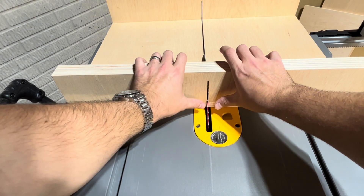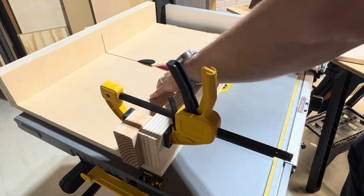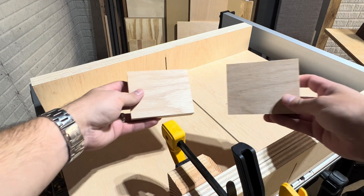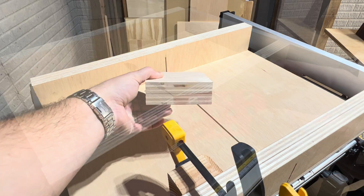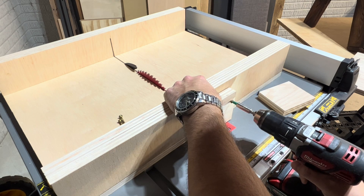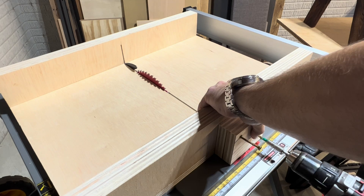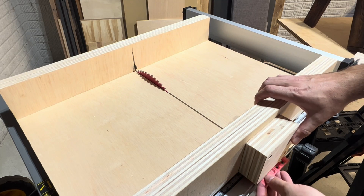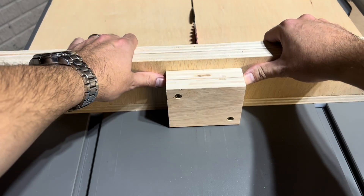Next we need to add protection to the back of the sled to help keep your hands away from the blade for safety. I clamped down a scrap piece of lumber for a stop block and cut two pieces of three quarter inch plywood at three inches high by four inches wide. I used a 1/16th inch spacer — though a variety of materials would work. Align the first piece to the blade and secure it with two inch screws, then place the second piece over and screw in the screws in opposite corners. Remove the spacer and now when making cuts you can place your hands to the left and right to avoid getting too close to the blade.